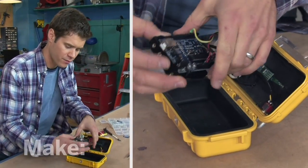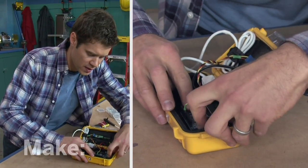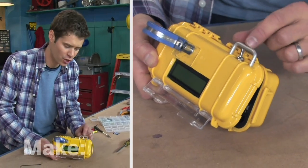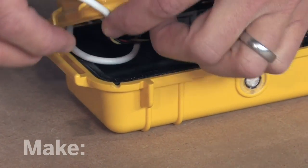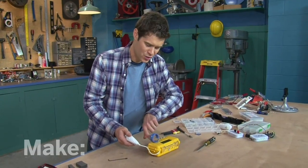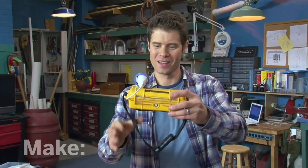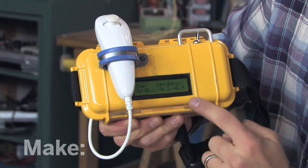Here's how it all fits together on the inside. I've mounted the Arduino to a battery pack with a zip tie, and this fits in really snugly thanks to the rubber interior, so that's not going anywhere. The nunchuck is attached to the Arduino. I've got my battery pack running through a little switch so I can turn this on and off, and I even put a little protective guard there so I won't accidentally bump that. I also cut a little notch into the corner of the case so that the wire of the nunchuck will fit through. I've got this great hose clamp that the nunchuck slides into, and now I just need to screw that down and I'm all set.